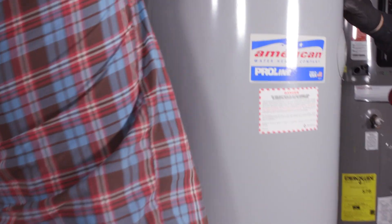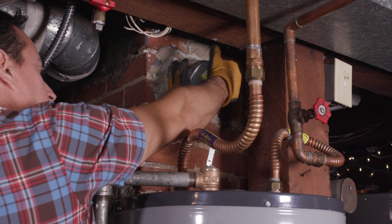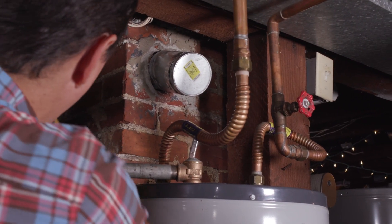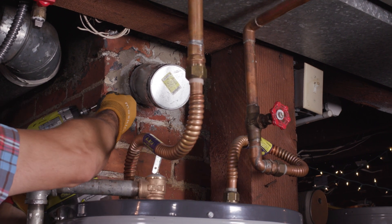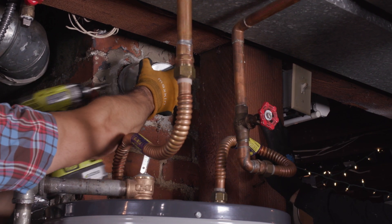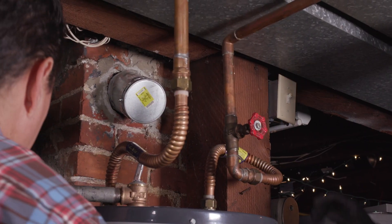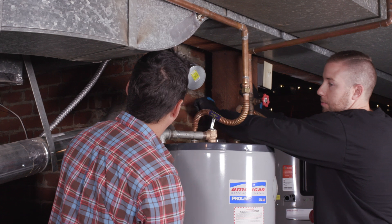It fits really nicely and it should just compress in — it doesn't have to go in all the way, only about this far. Now you can put a couple of screws in there; it's got a lip for screws. These are not self-tapping. Sometimes it's hard to get a good angle, so you might only get one in now and put one in later after the tank's out. Your drill is not going to fit up in here, so you can put one in from below and one in at best from here — that's all you're going to be able to do.